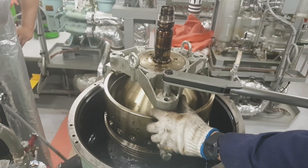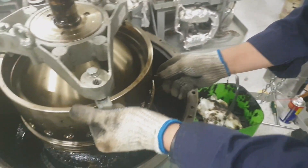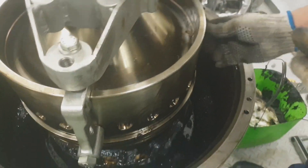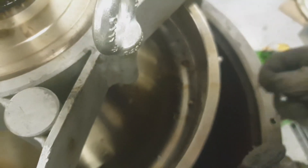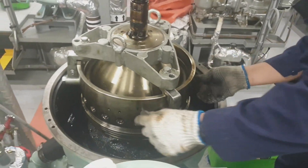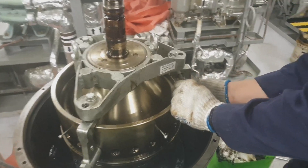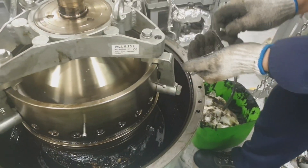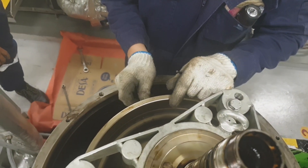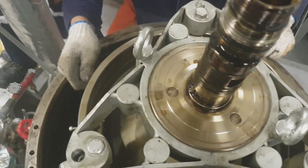When you hear the ticking sound of the torque wrench, you can then install the Allen screw. I start from the end-to-end part of the lock ring and work all the way around the purifier. When screwing the Allen screw, we have to alternately tighten the screws until we can feel that the lock ring is going — otherwise it will damage the lock ring.